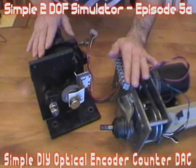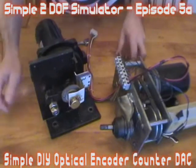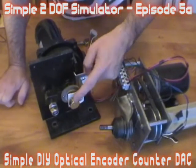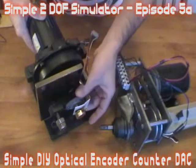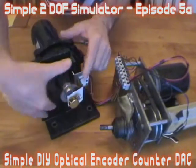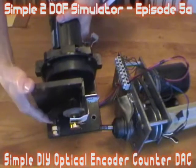These two actuators are from my 3DOF and 2DOF motion platform. The solution I came up with for position control were potentiometers. One was placed here on the business end of the crank, so when it turned, this potentiometer would turn around and give me the position feedback.